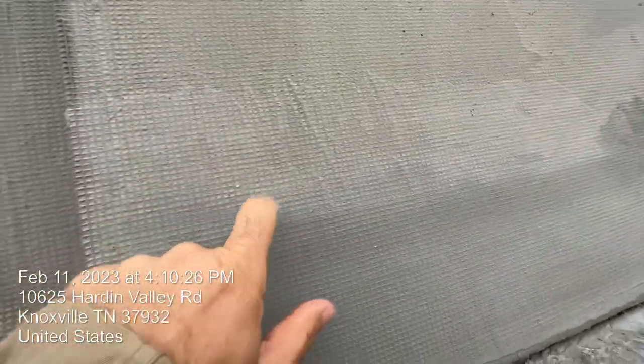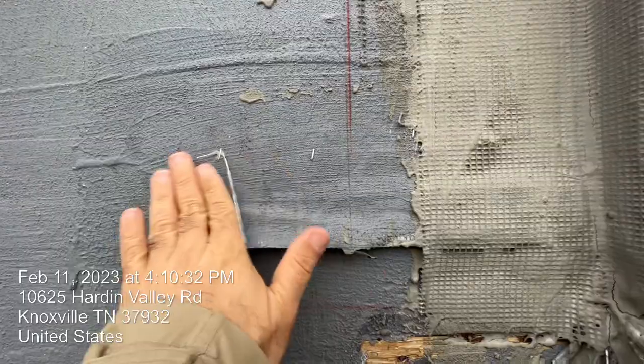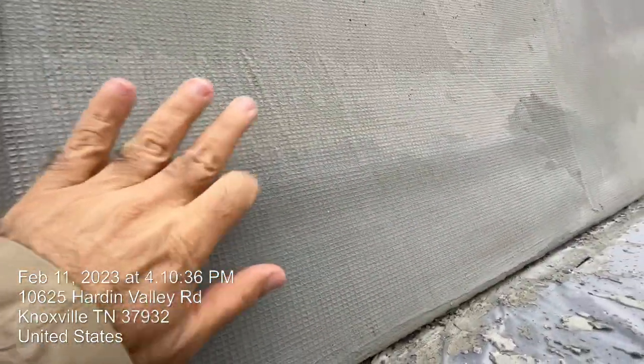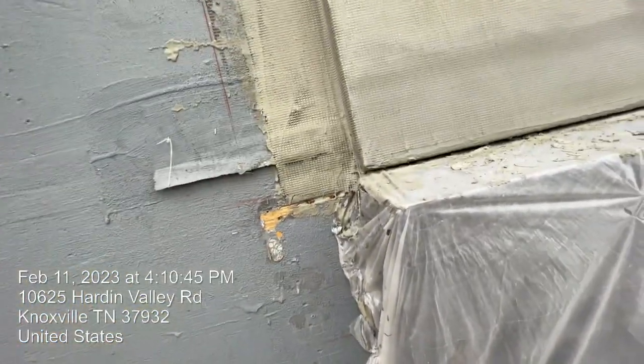You can see the wire mesh — it's a skinny mesh. So that's the plywood, then the waterproofing or damp proofing, then we put the mesh and apply the scratch coat. That is the flashing we used behind the bricks, and the same thing is done with windows.